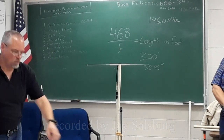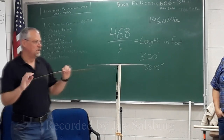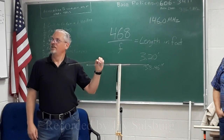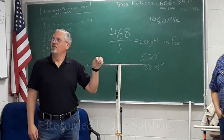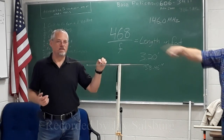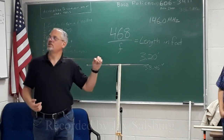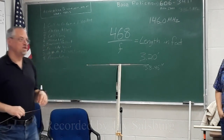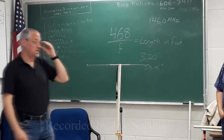All right, what happens if I have some other object come near it? Yeah, it's going to shift it. Turn it 90 and set it on top, or lay it there. Look at that. It affects my impedance. I'm going to back up. Yeah, get closer. That's why I say everything around your antenna is going to affect it, including us.